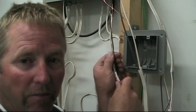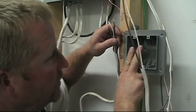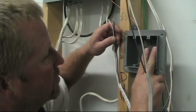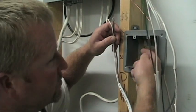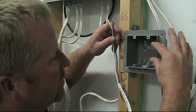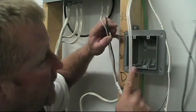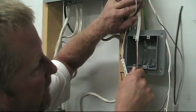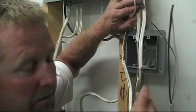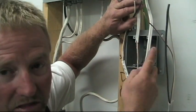To keep that straightforward when I'm making my splices, this is going to be switch position number one and this is switch position number two. Your terminals for the switch are on the right hand side of a single pole switch, so I like to keep my wires going out to the lights on that right hand side, preferably at the top — but that doesn't matter if you've got cables entering at the top or bottom. I'll just keep the same pattern.